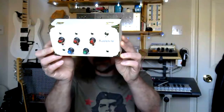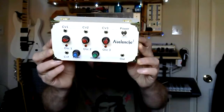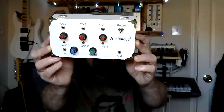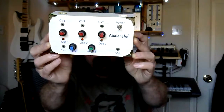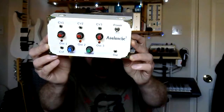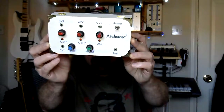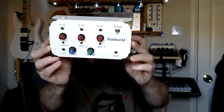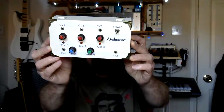What I actually did was I built three of these and wired them together into one box. So this is called Avalanche 3. The three red knobs are the frequency controls for each of the oscillators. There's a little LED on each knob that flashes at the rate of the oscillator. The green knob is a volume control. The blue knob — I put a low pass filter on it, a passive low pass filter, the same as the one I used on the NeoPunk box. It doesn't seem to do much on this box. Try ideas out, it's all part of the fun. Some work, some don't. On this one I got distracted by my next project, so I never got around to doing anything with it, so I tend to just ignore it.